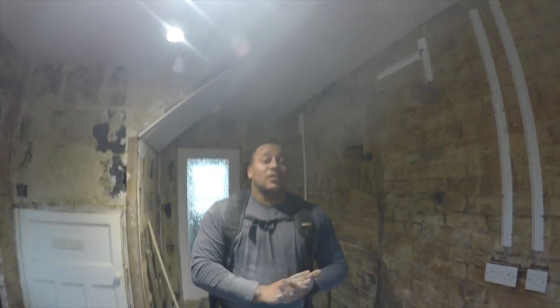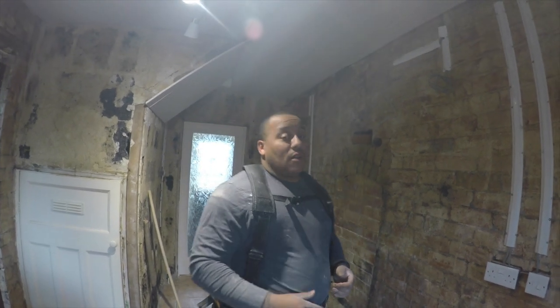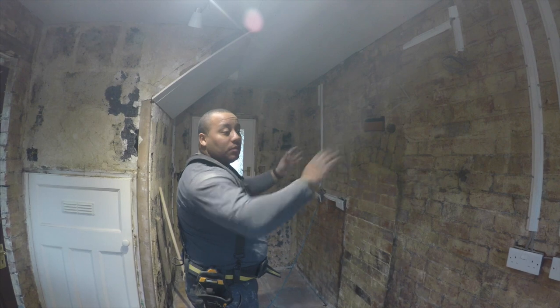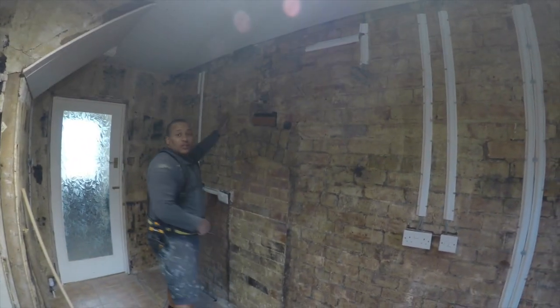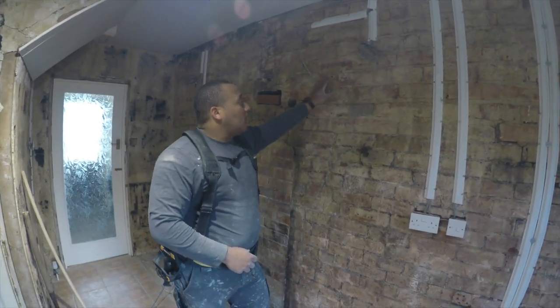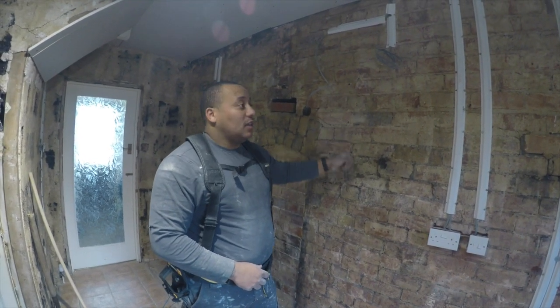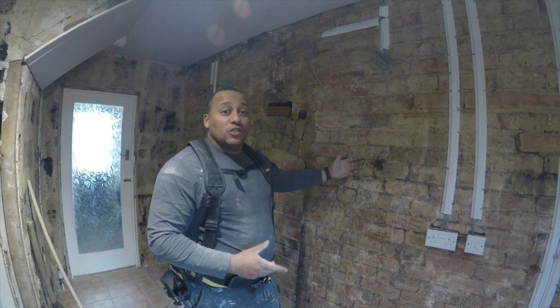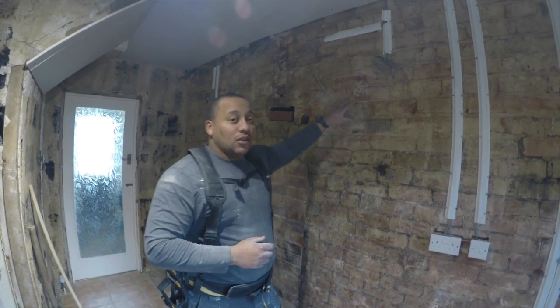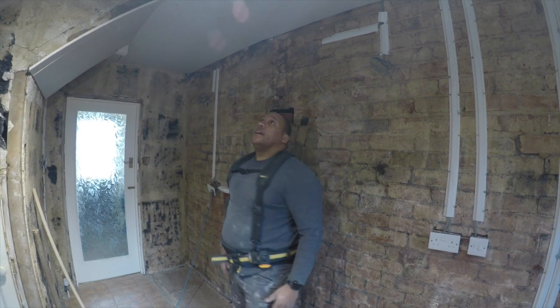Basically, we're boarding the ceiling. The ceiling went down to board, but when I came and looked at it I thought it looks a bit short and dark, so I've chucked a few more boards on. We're going to dot and dab these walls now. Sam's PVA'd all these up already — they're all one-coat PVA. PVA just stops the dust from coming up. If you board straight onto a wall with dust on it, it won't be long before they delaminate. PVA seals the brick, seals the dust, stops it in. PVA'd everywhere, outwalls been PVA'd.